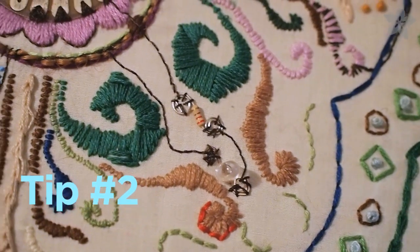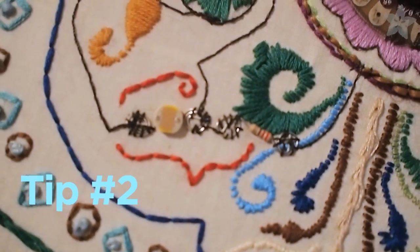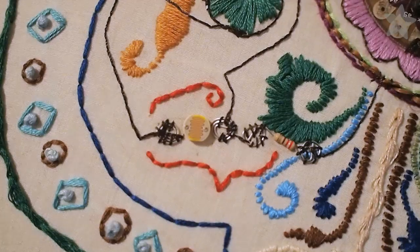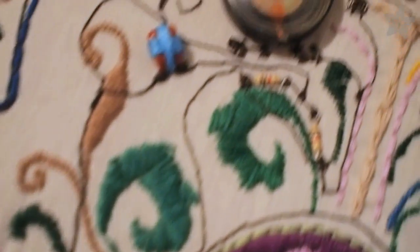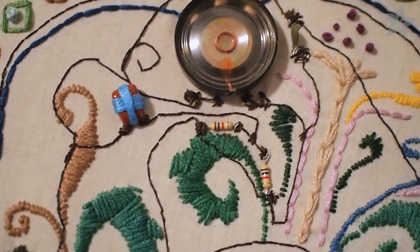Here's an embroidered circuit I made in 2008 with silver-plated nylon thread. Over time, the filings that comprise the plating tarnish and oxidize and prevent electrons from being able to flow. The thread turns black and the circuit stops working. It's so sad.